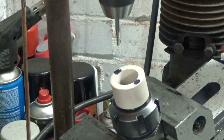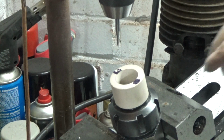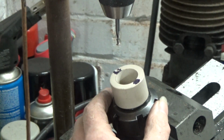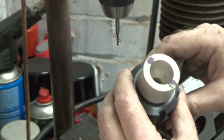The first step is to drill 3 angled holes around the circumference of the part. I had determined from the 3D model that I should be able to measure 5.5mm between the inner edge of the cutter and the outer of the part, but again, this is not especially critical. What is critical is remembering to tighten the vise before starting the cut. I decided that I could machine some of the damaged face away to hide this mistake.